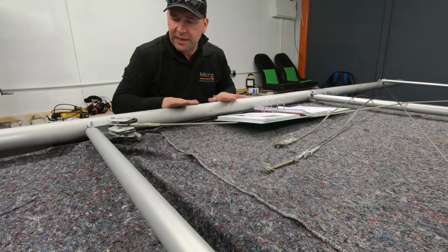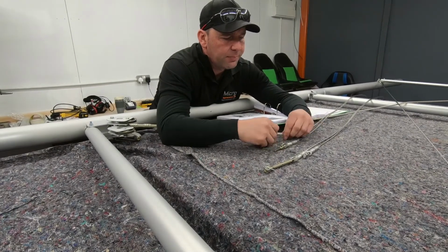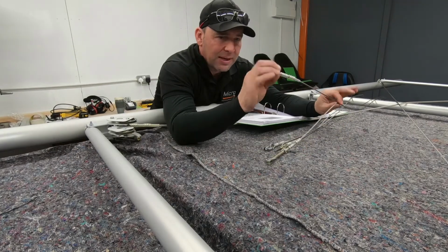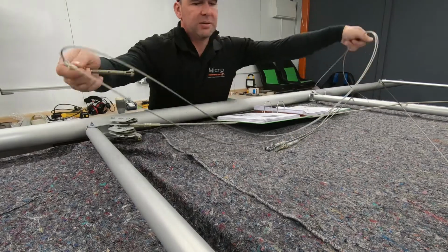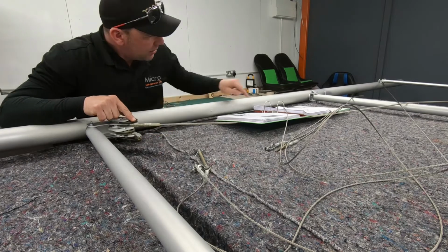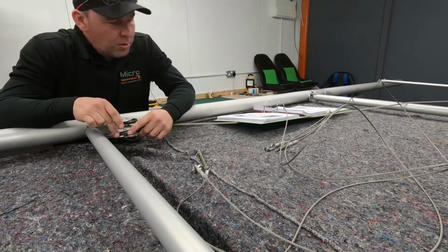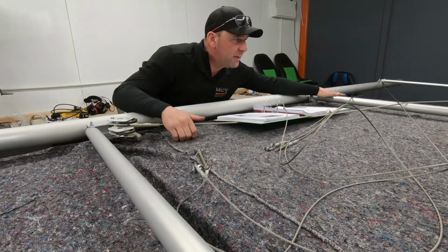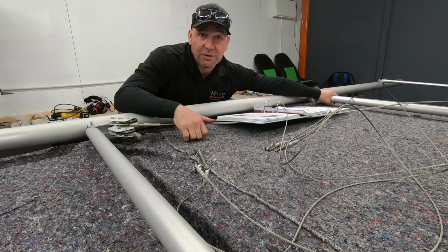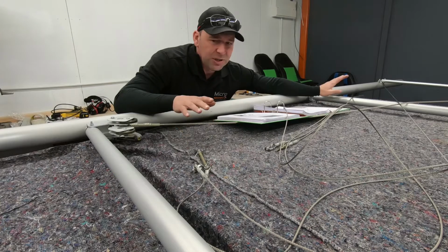This is a port side wing, so this cable should be number 6A. We're looking for the upper aileron cable at this time, and what we need to do with this is thread this one through the upper pulley, and then it goes through the U-bolt that's over here. The other one goes through the lower pulley and then goes over the top of this SKR37, if that's the right tube. I'm sure it will be flashing on the screen if I've got it wrong. So we're going to do that now.